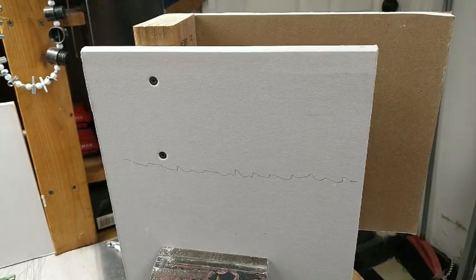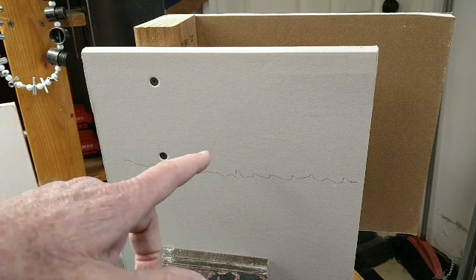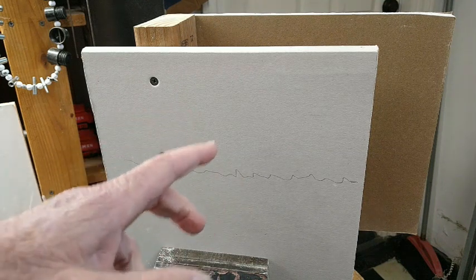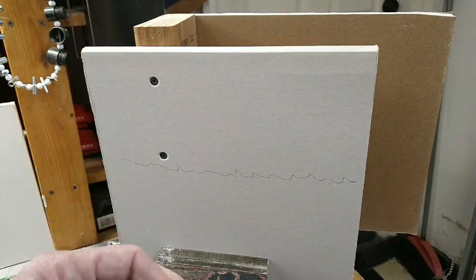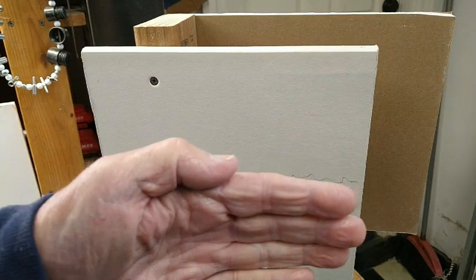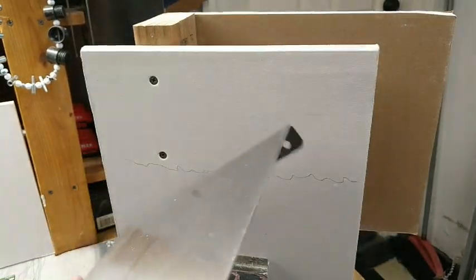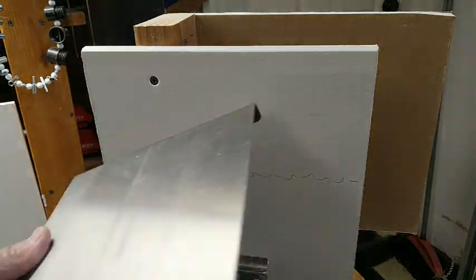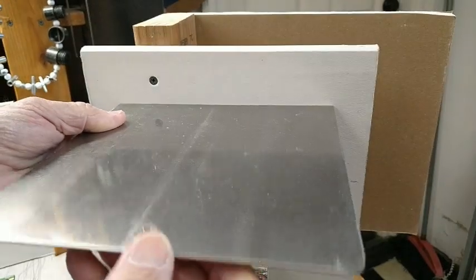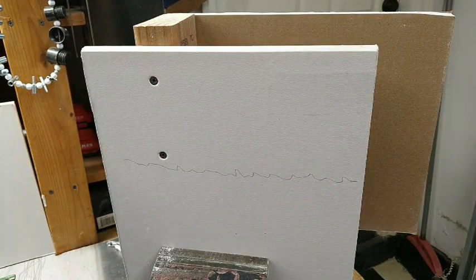Here's where I have to get a little into the tech stuff: anything other than stick-ons that's going to go into the drywall, even a nail, you need to verify that they'll go in adequately and that they'll hold close to their rated poundage. They never tell you what they'll hold coming out horizontally, like a shelf. If I make a shelf and it's cantilevered out, they'll say it holds 10 pounds vertically — but how much can you put on the shelf? Sure, it won't be 10 pounds.